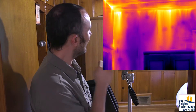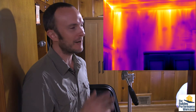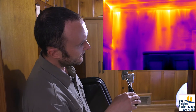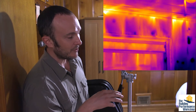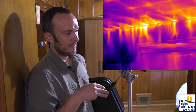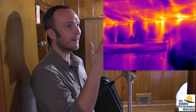When we scanned this room earlier there wasn't much to see, but now with the blower door running you can see the wood paneling covering the walls — not drywall. This stuff is horrible for air leakage. Whenever you see wood paneling, there's going to be a lot of air leakage coming through the paneling and down from the attic and up from the crawl space. You can see it coming all over the place, mostly down from the attic and around the window. It's generally the way a window is installed that's bad, not the window itself.